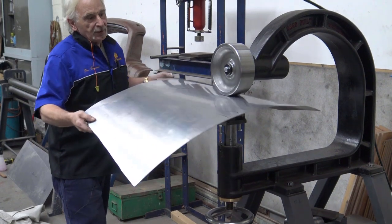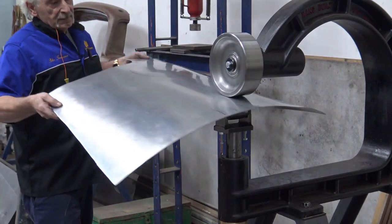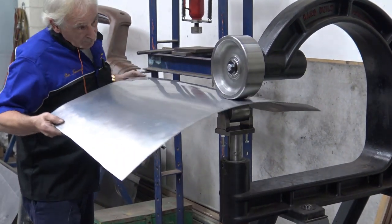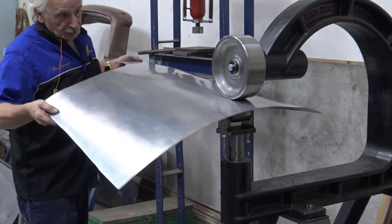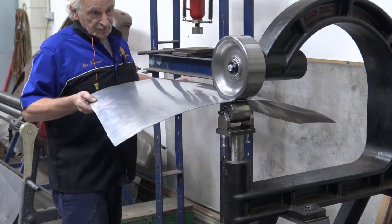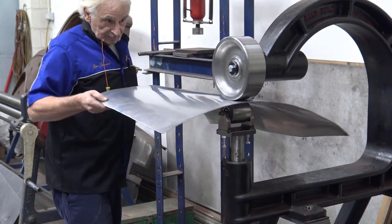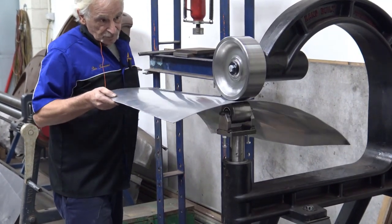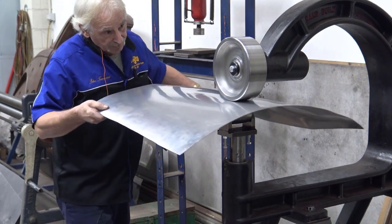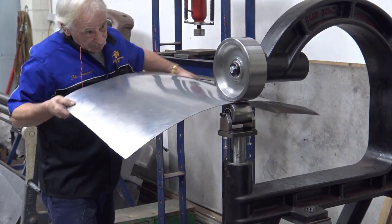And you literally walk that material away. You can see it. You just move up, move up, move up and out, all the way down here on the blend. Very slowly does it. Take your time with this. Now you get down here, very slowly, you stop lifting and you go straight. Yeah? Just go to the corner for the time being. Then come back. Start lifting a little bit, little bit, little bit, and then go for it.